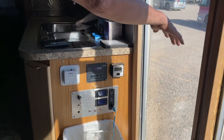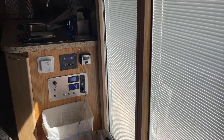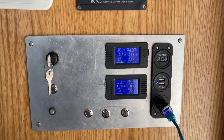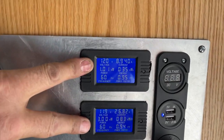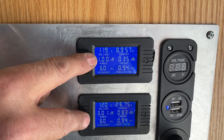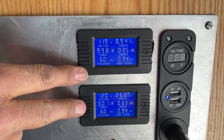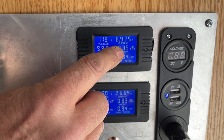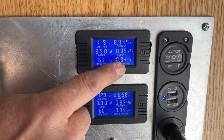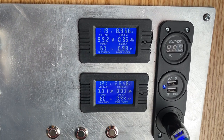We might need to close the blind for that to show up properly. There are your screens on there. So this is 220 volt — 50 amp service — it shows 60 cycles, wattage, and voltage. You've got 109 volts, 119 volts, and 120 volts, so this is a 110-volt circuit. Combine them both it's 240 volt. It shows the current amperage and kilowatt hours, like you get on a bill from the power company.